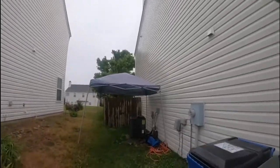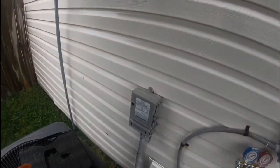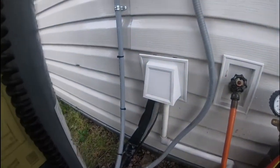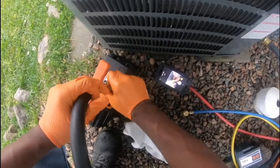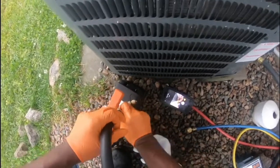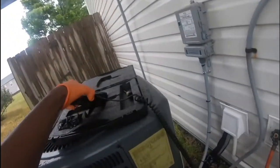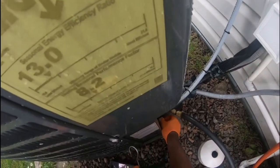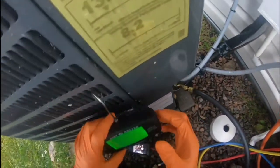I am at a client's house. We just finished changing the TXV and I am about to put the NAVAC 4CFM to the test. I'm hooking up the JB super evacuation kit — let's hook this up to the 3/8th port here. Now let's hook the vacuum gauge to the liquid line, and I have the other end on the suction.